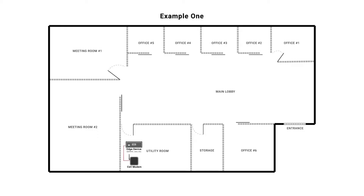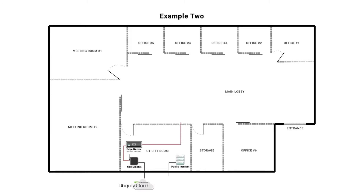Now we'll show you how this all goes away when we connect to a network using the Wi-Fi Ubiquistat. The Ubiquistat is wired to the unit just like any other thermostat and the Wi-Fi chip is already on board. A gateway or edge device like the QD3040 or JACE is connected to the same network as the Wi-Fi router. In the first example, we'll use a Wi-Fi router dedicated to the control's network, and all the Wi-Fi Ubiquistats communicate to that edge device by passing through the Wi-Fi router. In the second example, the Wi-Fi router is part of an existing public network, like one you might already have in place to provide Wi-Fi for customers or employee smartphones.